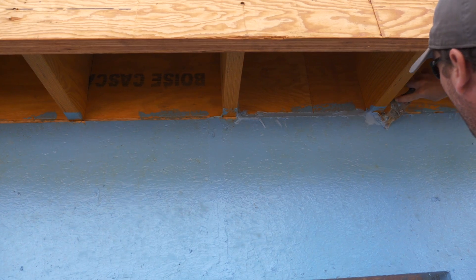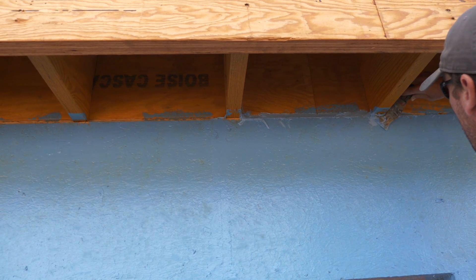But overall we were able to get it done and it really applied a very thick membrane to the entire house, which I think is going to be super durable. What do you think the millage is on this? This is every bit of 60 mil — it's probably pushing 70, 80 mil because it's rolled on. We used a little bit more product, but it really will be durable, and that's what we were really looking for.